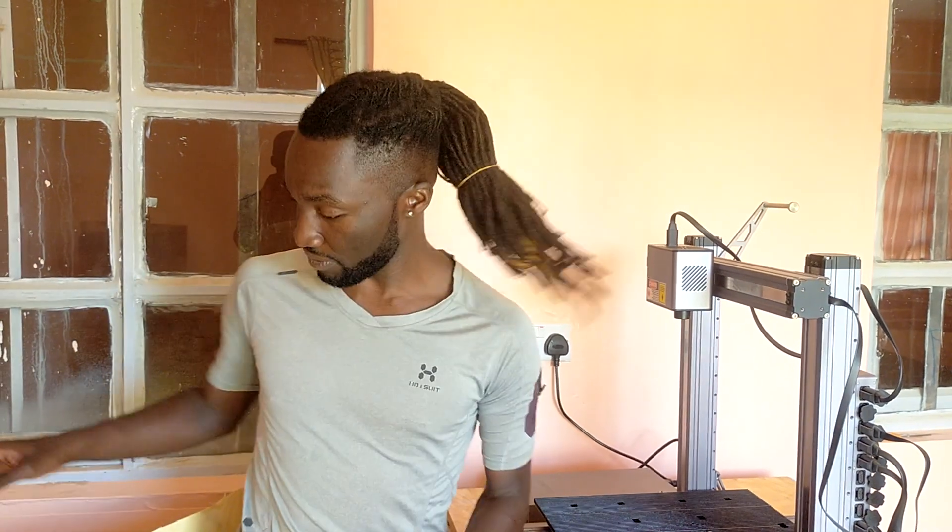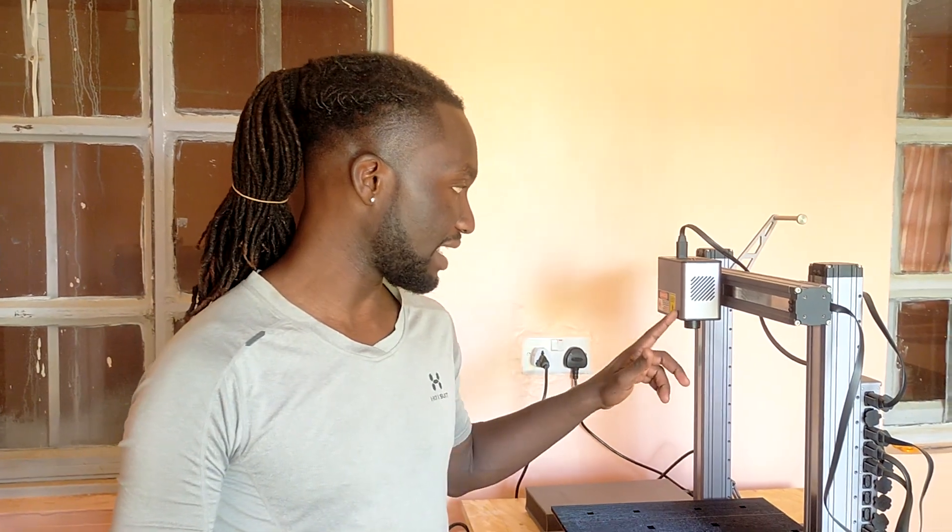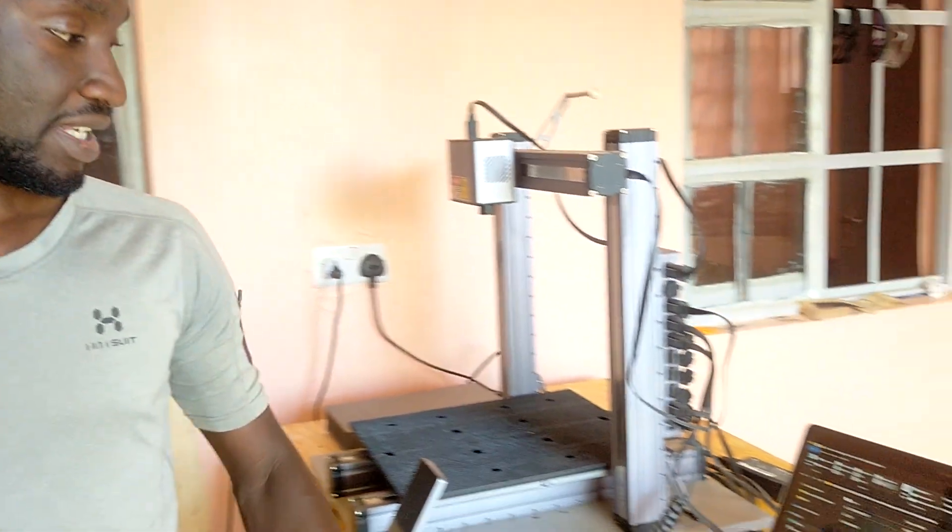When it comes to engraving, you can engrave a wide variety of materials. The usual stuff — we'll be engraving a lot of wooden planks. Apart from wood, you can also engrave leather, slate, tiles, ceramic, and a lot more. You can't engrave metal with this laser module — the power isn't enough. However, there's a workaround: spray paint the metal first, then engrave. You won't cut through the metal, just engrave the paint on top.